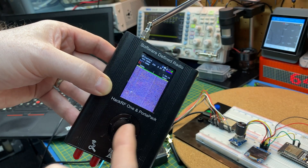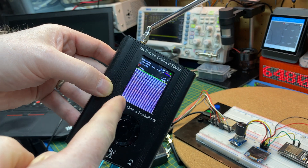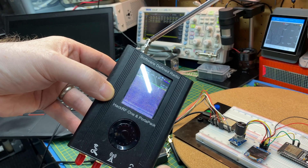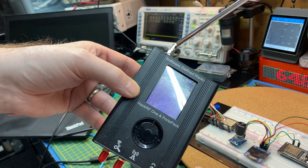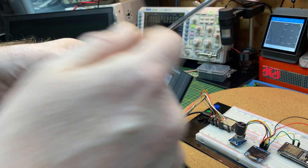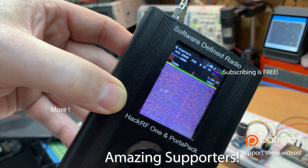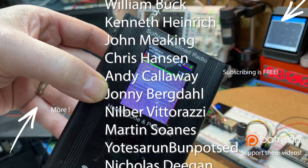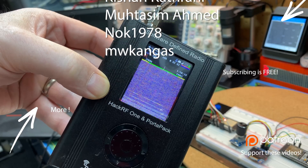So I know my pins are right. I know what register settings can produce radio output. I still have the sketch I found online that may or may not actually work with the diesel heater, but if his decoding is right, we just need to make the radio talk. HackRF put to work beautifully — what a great tool for this. Just amazing.